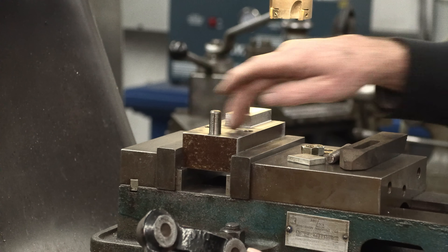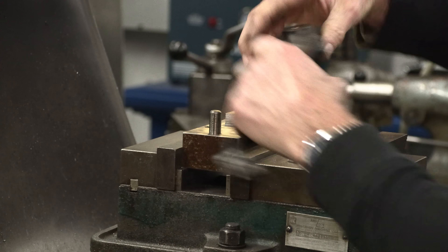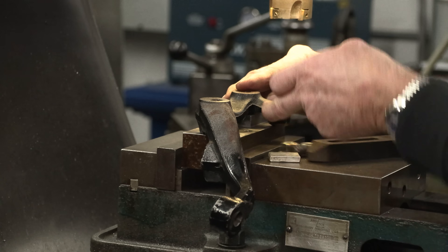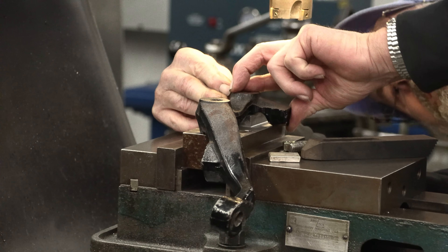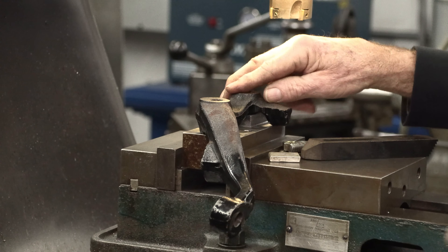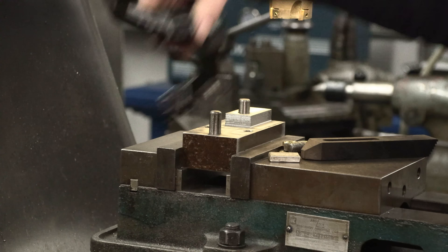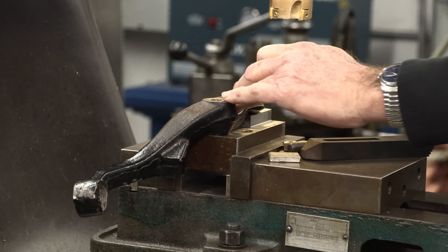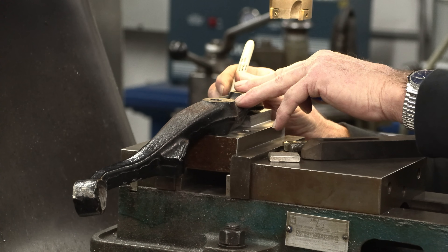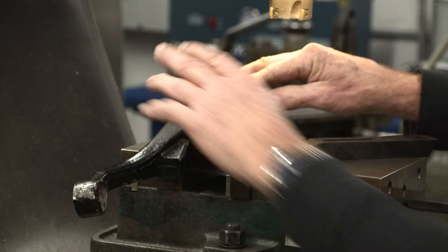There's a half-inch difference in height. So we took our turbo end mill and milled out here, then went down each side because the ear on the small end has got to hang off the side. When you put the opposite hand on here, it overhangs on the other side. I just noticed right there and there — this is just a rough surface, but that one might even be making contact. We're going to hit that little area with the sander, but let me get back to how we're going to hold this down.